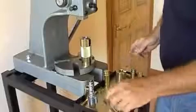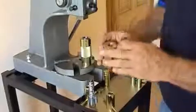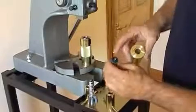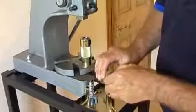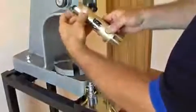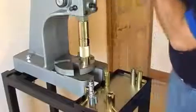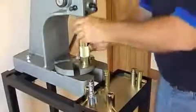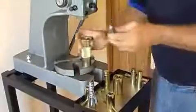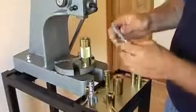We then focus our attention on the turret and the valve. The main difference here is we have a cutout that we must align with the larger of the two notches on the turret. So we insert and align the large notch, then the two are brought together and we align the front two cutouts. We are then ready to press and roll the canister back together. One completed solenoid — notice the notch that hasn't been rolled over, bringing it back as normal.